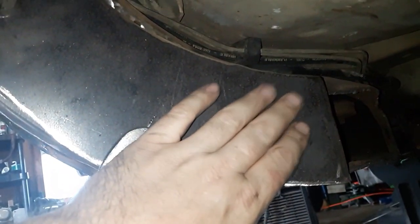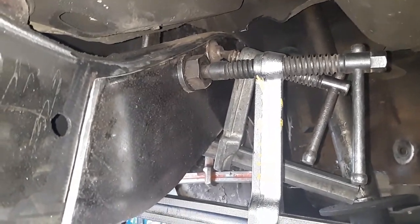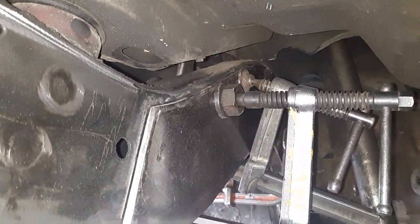Pull a clamp to pull this in. I'm going to start tacking the bottom and the top up here because it's all fitting good, and then I'm going to burn it in. As I said, you'd be surprised what you can move with some clamps. Had a problem with a gap up there. Got another clamp put on there. Tightened both equally, one after the other. Got it all closed up.